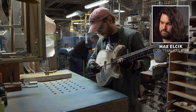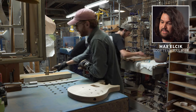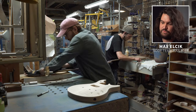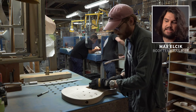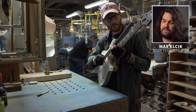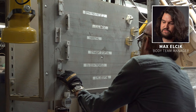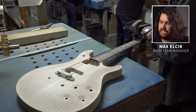He is also going to be checking a couple of specs here. First up is our neck angle. He uses a nice long straight edge along the neck and a six-inch ruler, and he is checking the height of that neck angle off of the bridge. That gives us an idea of where the neck is going to sit in relation to the body and whether or not he needs to take more off on the heel to adjust that angle. You can see him going back and forth with that straight edge and the six-inch ruler just to make sure that it is absolutely dialed. It really makes a big difference with the setup of the guitar and bridge height — everything else kind of falls into place.